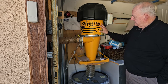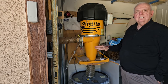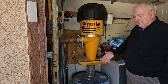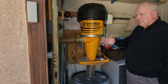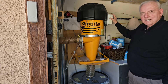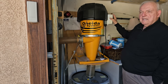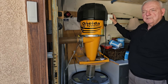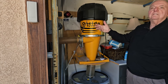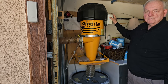Our Oneida system here is probably one of the best dust collectors I've seen for a small shop or even a bigger shop. It absolutely keeps everything clean — you don't get all that fine dust everywhere. But it has a magnetic switch, and the magnetic switch has been the problem, because if you use the IVAC remote control on all of your tools, which turns on the dust collector and turns it off when you turn on the tool, with the magnetic switch you lose that ability.